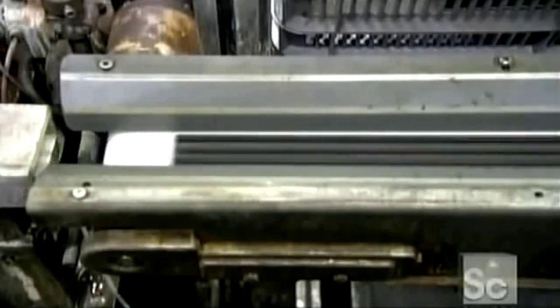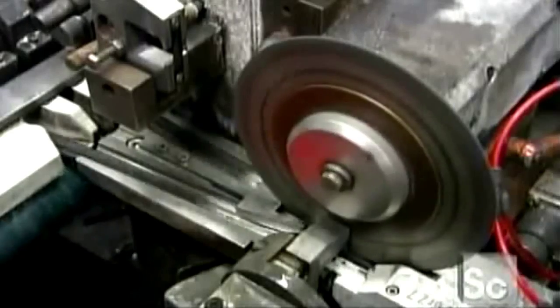The rubber band cools in a salt bath before it's cut into lengths, then split in half to form two wiping blades with a clean, sharp edge. The blades go through a spray of graphite to reduce friction, then drop onto a grate to dry out.